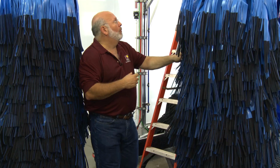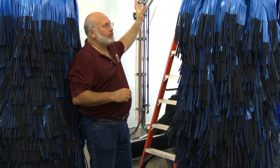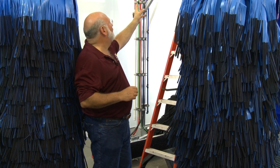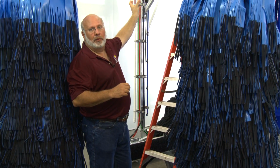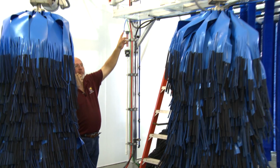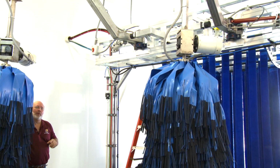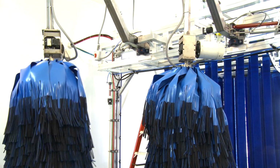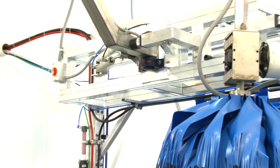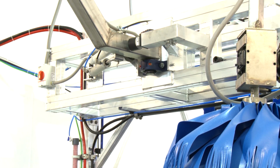We're going to go up top now and show you how to do some adjustments on the spring stop, show you how that works. I'll actually show you from down here where it's attached, and then we'll talk about the bearing adjustments and the bearing greasing. But if you can take a look up top at that bumper stop attachment, when I push this brush in to come home, it's a spring-loaded bumper stop. So it takes a lot of the cushion off of the vehicle and off the frame of the machine. It makes a nice soft motion when it comes across the back of the vehicle.